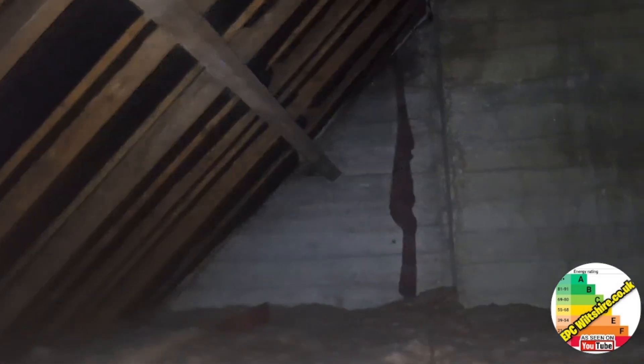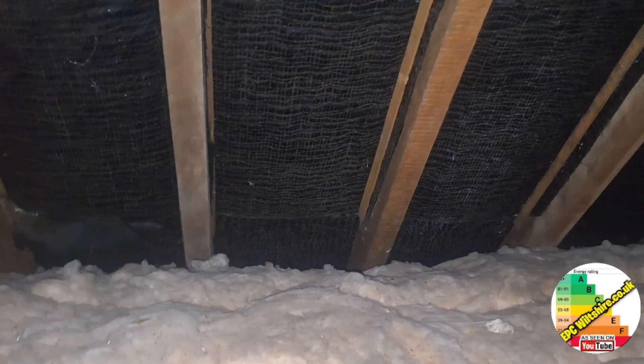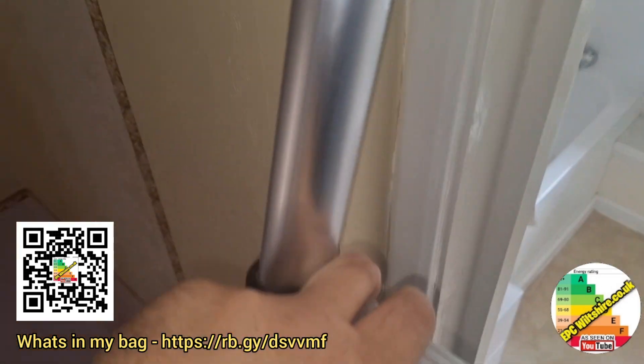Let's go and check out the loft. Here is a certificate saying how thick the insulation is. Here we see the party wall — you can see where it had been poured as the formwork has been left with some horizontal lines on the party wall. The insulation thickness is 200mm. Remember three points of contact on the ladder. It's quite difficult holding a camera, a tape measure and measuring loft insulation, but you can always make notes on the site notes to keep the auditors happy.